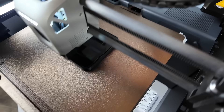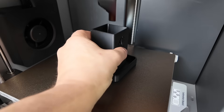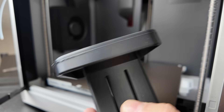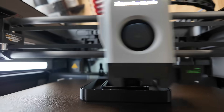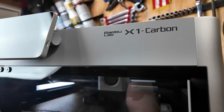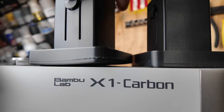Now the real question is will these filaments work just as well outside as they do inside? We found the perfect part online — a trailer hitch cover for our F-150. For this next test we're using PETG, ABS, ABS GF, and this time ASA, which is similar to ABS but with much higher UV resistance. We had severe warping with ASA initially because it was chilly in the garage. ASA likes to print nice and warm, so we upped the bed temperature, preheated the printer, and the part came out way better.